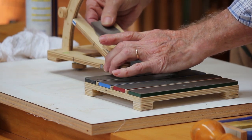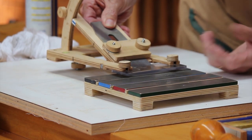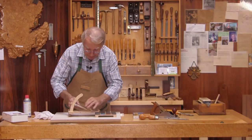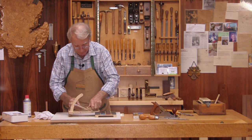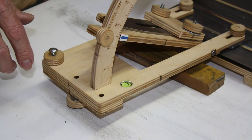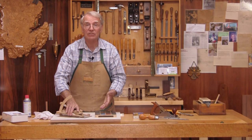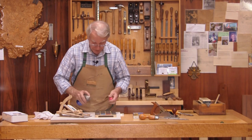Push it down to make sure it's up from the stone. There are lines in here so you can line it up beautifully, and then you lock it. There's a screw on the bottom which you adjust, and a level built in so you just keep going to the right height. The best lubricant for the diamond stones is any mineral spirits — I use WD-40. It's an easy, quick, and very good lubricant.